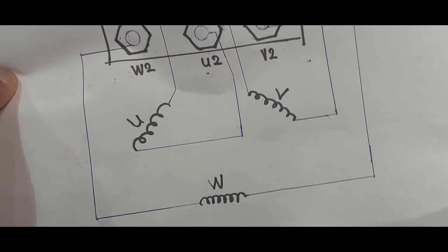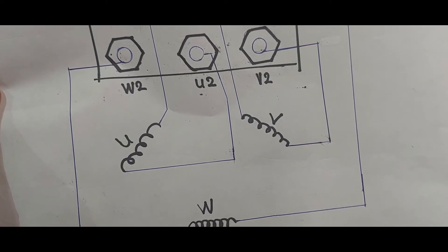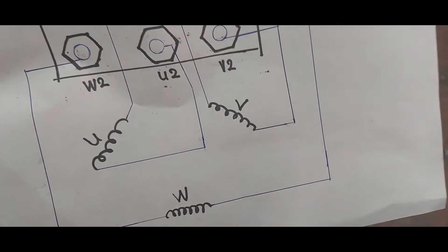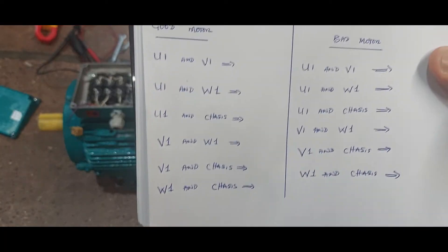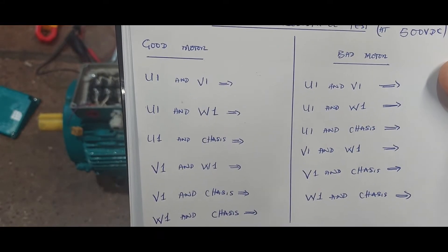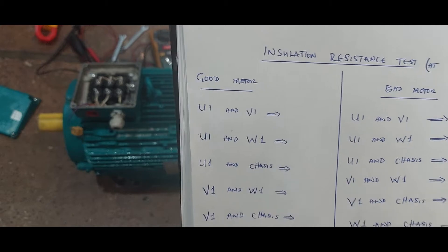But if it is low resistance, around two to three ohms, it is going to be good — at least low resistance is good. If it is very high resistance, then it is bad. For the insulation resistance test at 500 volts, we are going to be injecting 500 volt DC and then we are going to check to see what the reading would be. So let's start.